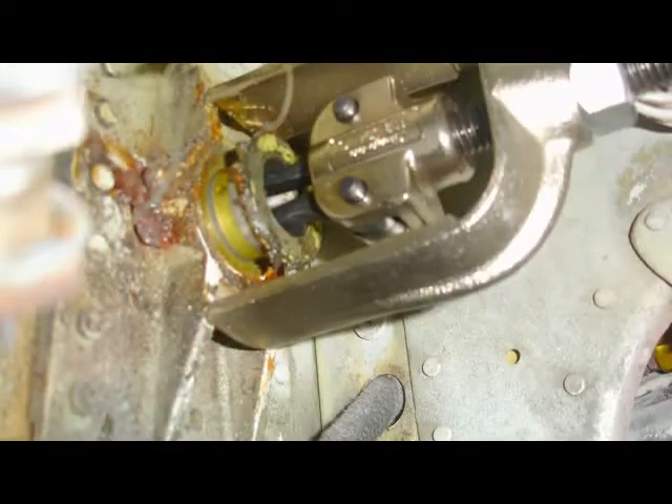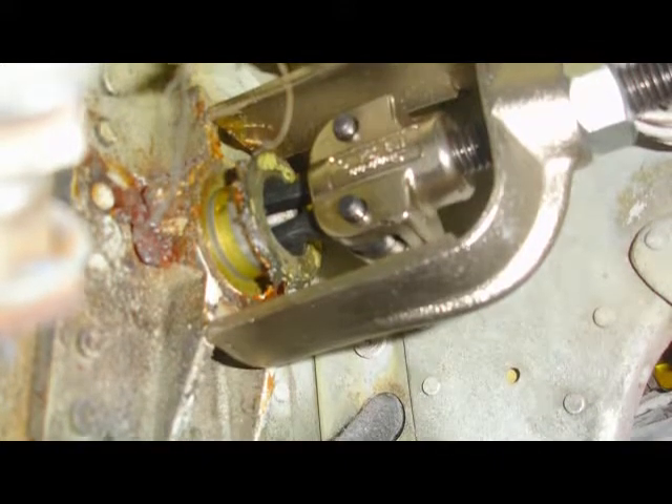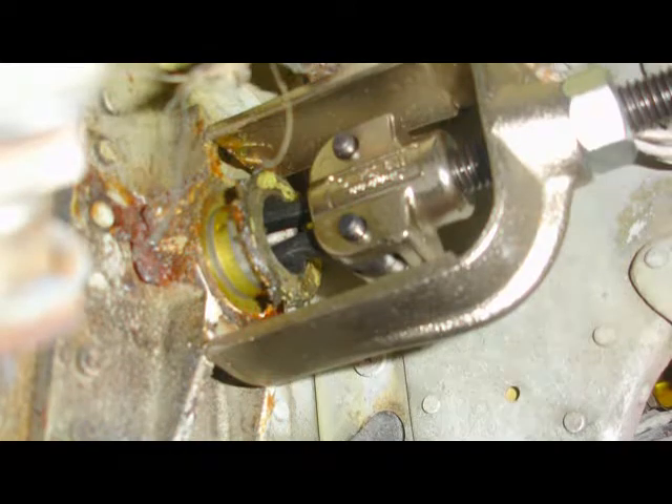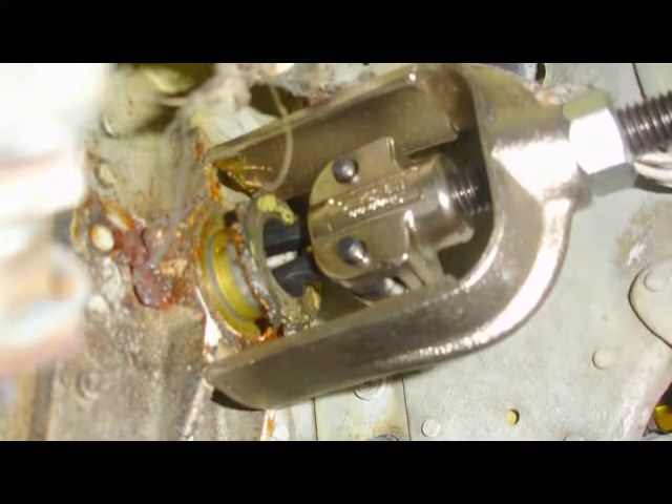In this shot, Jimmy's using the new snap-on puller. Two legs grab the back of the bushing while the U-shaped housing bears up against the trunnion plate. You can see the Zerk fittings still in place and the hole in the bushing it connects with.